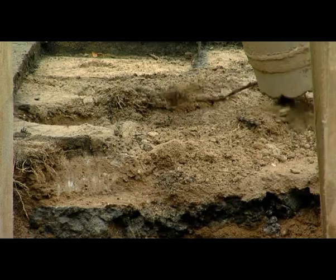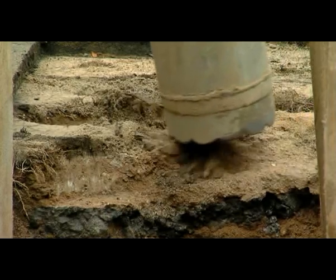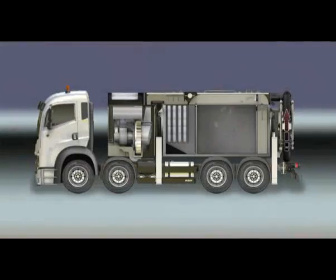The material that is excavated reaches the central collection area via the suction hose. All the major particles settle here because of the drop in air pressure and circulation. The flow of air is then cleaned and dried using the outlet chambers. The outlet chamber guarantees that the pressure on the fine mesh filter is very low, and therefore high suction power is available even when removing water or damp media.